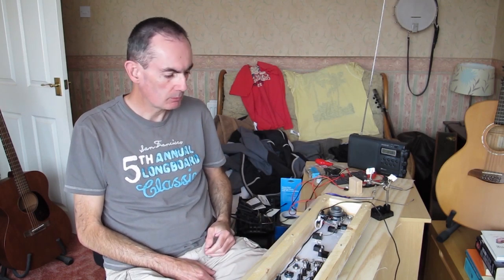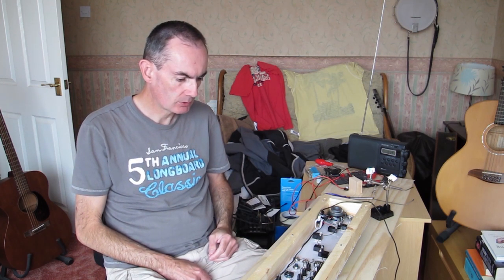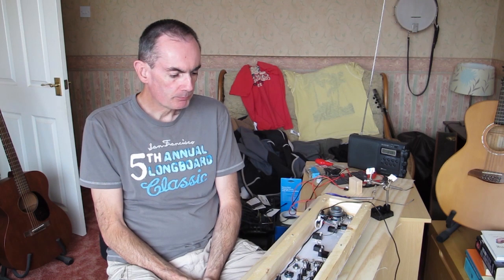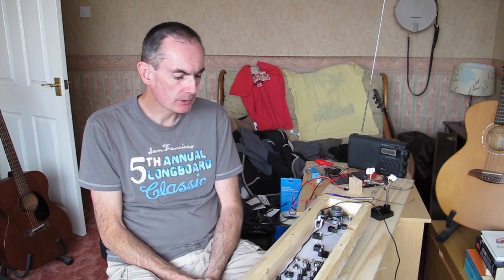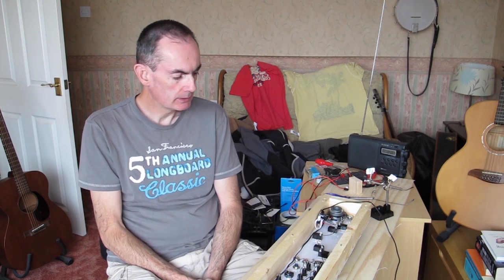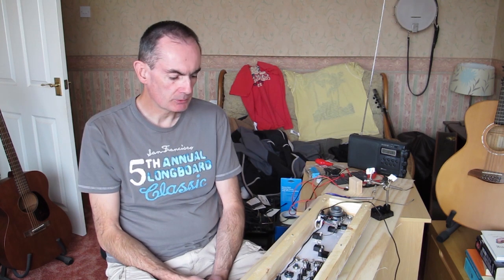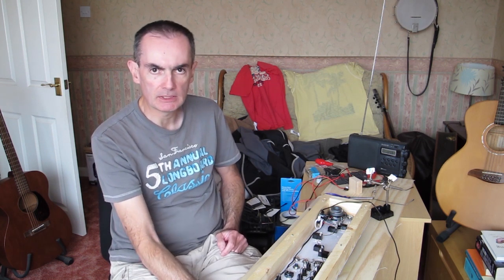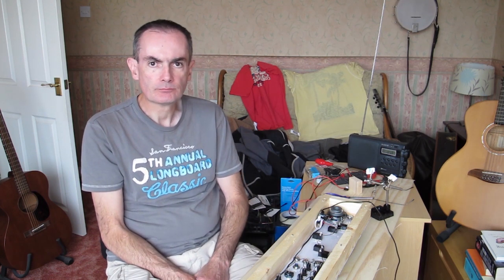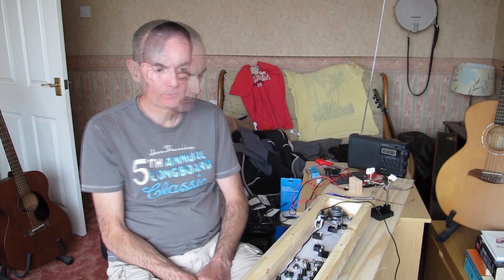Well, that's the first round of soldering done. I've been working on the main autopilot panel and I've now soldered in all the common ground connections. So the next thing to do is to wire up the signal connections. That's basically one lead from each switch that has got to come out, and then we take one ground from this common bus. The next job is to dig out one of the 25-way D connectors — or two — I have to account for how many connections there are on there. Basically solder one wire from each of these onto one pin of that connector.